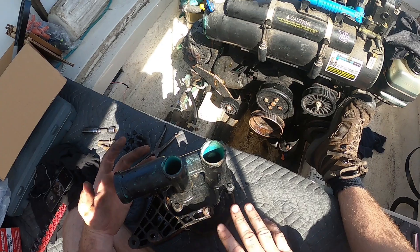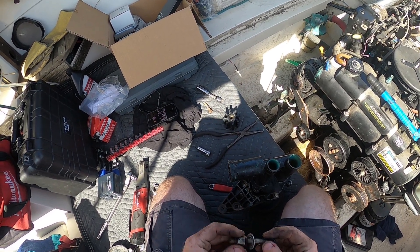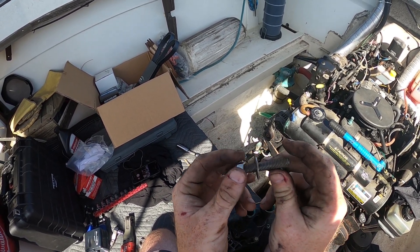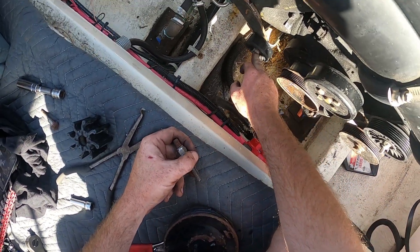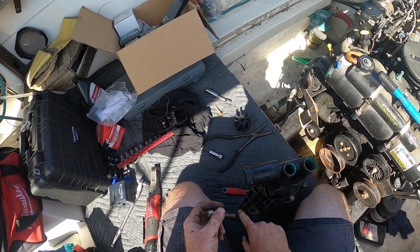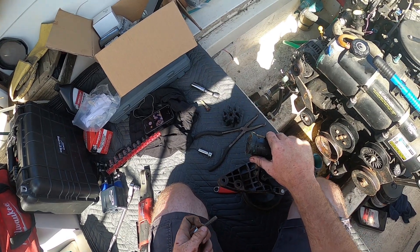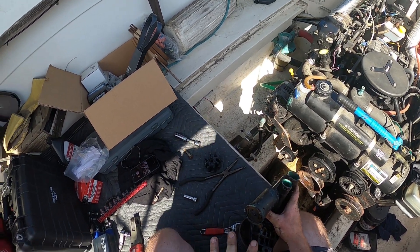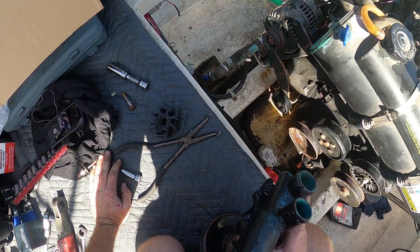The water pump is totally reassembled. Now it's time to put it back in. You can see the stud came out — the stud normally holds the water pump in place, but these studs get so rusty the nut can't come off. Later-year water pumps have a little J-hook piece, but earlier models like this do not. First, put the pump in the bilge and hook up the lower hose. The upper hose is easy to do once it's in place, but which is the upper and lower hose?